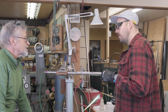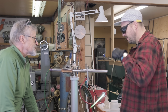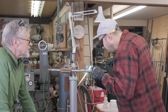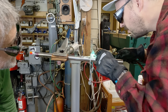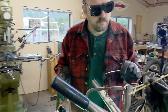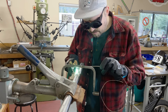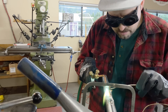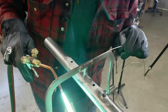Then put a blob over here, but I'm melting the first blob before I move over to the second one. Each frame builder has their own way of doing things, but this is what I would do. Okay, you're on your torch. I would have it less at an angle — you've got the torch up like that; I would have it more down like that, so the torch is flatter.